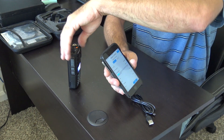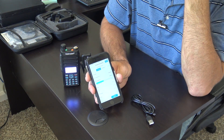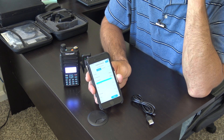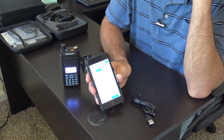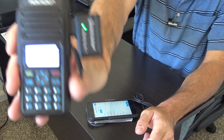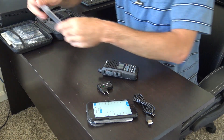And that's it. You see it is programming — it's flashing, it's writing on the app. Now when it comes on, channel one in channel mode should be the local 2 meter repeater — 146.640. That's the W4PHJ machine that's been tried and true from 50 miles each way. Great repeater. And look — you can see 146.640 right there in the display. It was that fast.